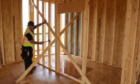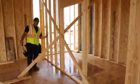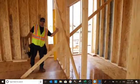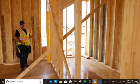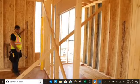We'll get this panel squared up on the ground. Of course, it's an interior partition wall. It's not sheathed, the reason being we have mechanical trades, electrician, plumber. Everybody's got to go through. So we don't have that option. So we've got to put these swing braces on because we can't put our sheathing on. So here you go. Now you can see how the plate level works, and those stand-ups on them.